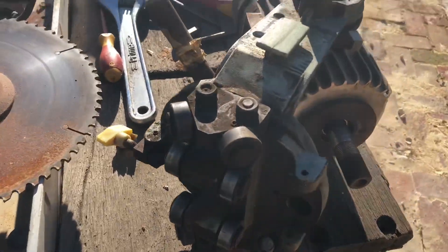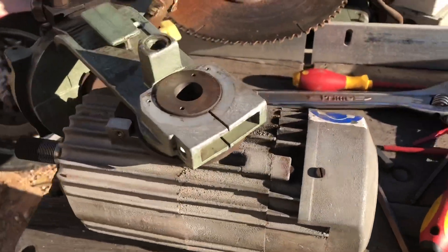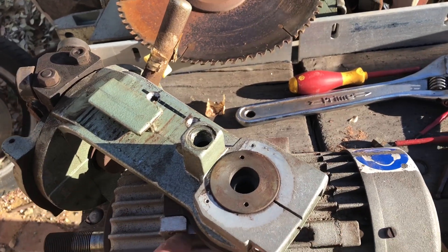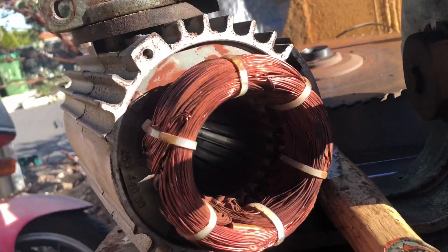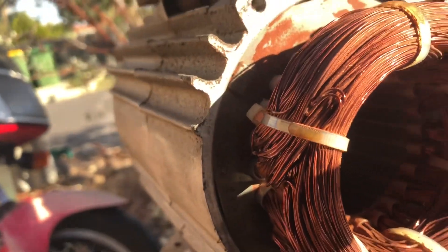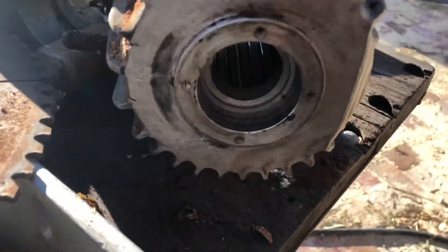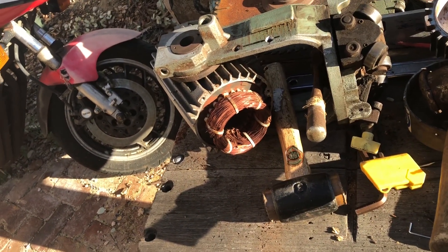At this stage we're taking the rolling head off the gantry, which gives access into the motor and the windings. We still haven't figured out how to separate this — not clear yet whether it's a press or quite what we need. A bit more low-tech than I was expecting inside here. We've got some coil windings — 255-40-50 as noted here. There's an inner lip there, I reckon that's just pushed in or pressed in, because there's no access from this side. We're going to see if we can't just pull it out. Well, that speaks volumes — these windings are absolutely shot.